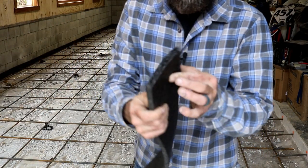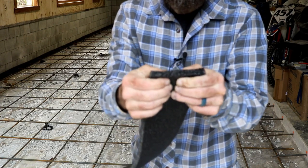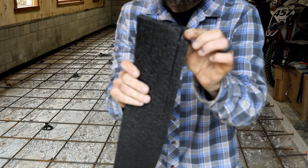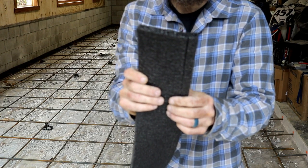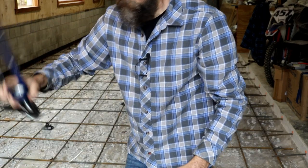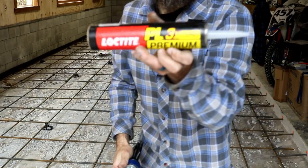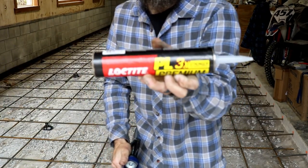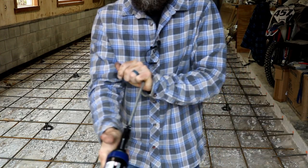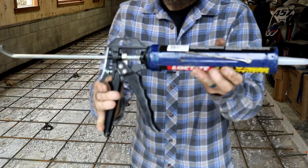So there's a look at our expansion joint material. Nothing fancy, just some soft foam, right? Got a tear line on it. Looks like you could take a half inch off of it if you wanted to easily. And we're just connecting that to the wall with some construction adhesive. Man, that autofocus is absolutely horrible. Using the old caulking gun, right?